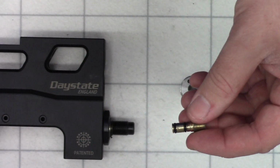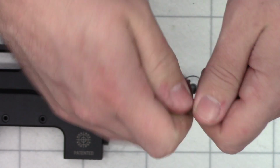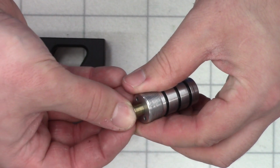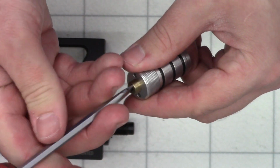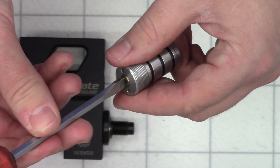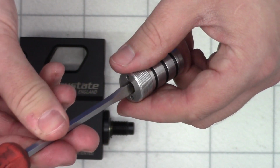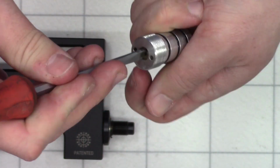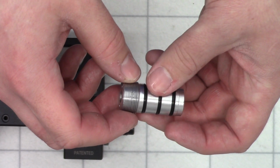So, again, small amount of silicone grease, wiping off the excess, and then gently pushing the piston, or the adjuster screw, into the top there, and using a flat bladed screwdriver, doing that up. The reason we flip the sealing puck is just because it's marked on one side and the other side should be nice and clean, which it was. The dimple can sometimes have an effect. Normally with the Huma regs in the rebuild kits, you do get a spare puck. But this one, because it's dual sided and only one side seals at a time, it is flippable.